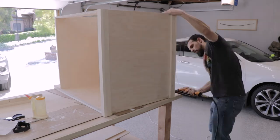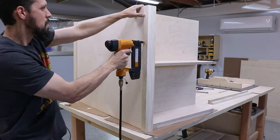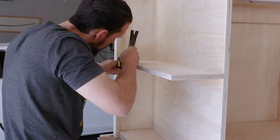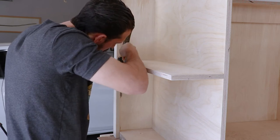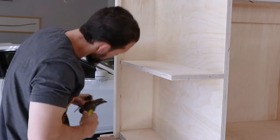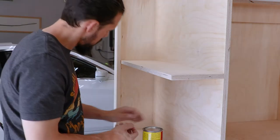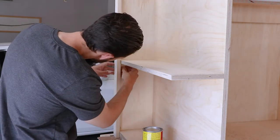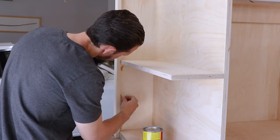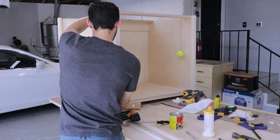As I'm nailing away I did make a bit of a mistake — one piece is just a single layer of plywood and not butting into the next one, so the nail went through the edge just barely. I used a screwdriver to bend down and embed the tip of that brad nail below the surface, then went in with wood filler, filled it in, and sanded it down. Afterwards you can't really tell, but I should have just used slightly shorter brad nails for that part.